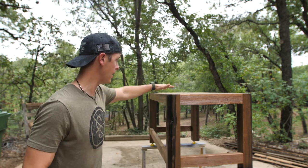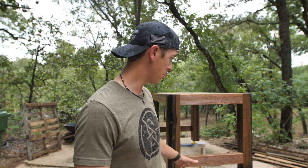I was getting sick. It was making me dizzy. Now I can tell you with confidence that this table is not gonna have that nausea smell anymore. I've had it inside of my office for 3 or 4 days now with no poly on top or the bottom, and I even burned some off the legs, and I don't have that noxious smell. I pretty much dried it out like a raisin, and now it's ready to have some poly put on top of it, where I think, as before, it wasn't ready.